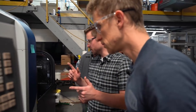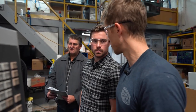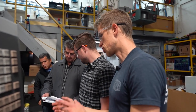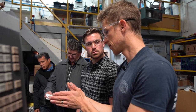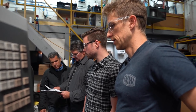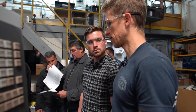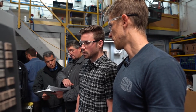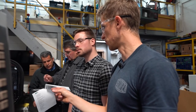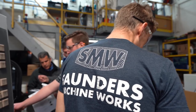What's the maximum length you could potentially machine? Well, I mean, you see how far we move back there. I think it's 9 inches. Oh, okay. Yeah, I think it's good. It should be in the specs, but with the chucker mode, it's only about an inch, I think. But with guide bushing, it's like 9 or something. Because you just imagine, it's clamped, and it's just pushing all that through the guide bushing. And if your parts are that long, you should be able to eject them no problem from there.